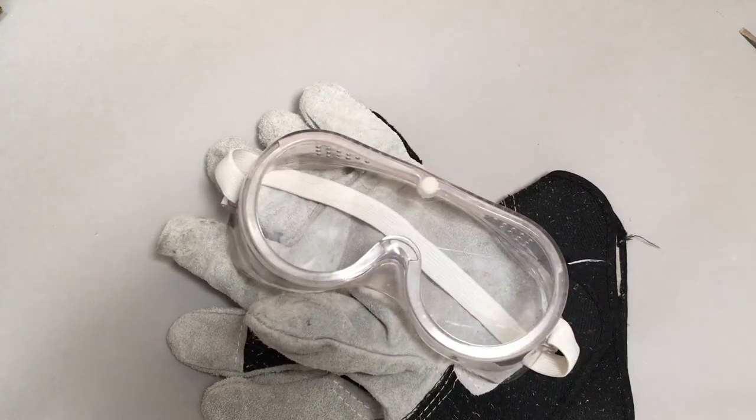When we talk about mainsprings we always think about safety. Mainsprings can be potentially very dangerous — they can store a lot of energy. So when we come to remove the mainspring and refit the mainspring into the barrel we're particularly cautious, and the same applies for letting the power off the spring. So before we begin we're going to equip ourselves with a strong pair of safety gloves and some eye protection.